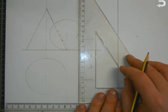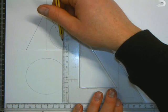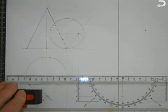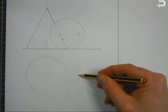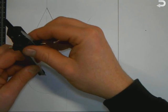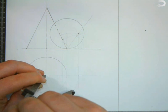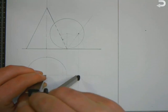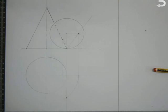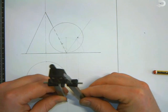To answer this question, we bring the center point of our sphere straight down, and bring our point of contact also straight down. From the center point, bring a line straight out. That location is the center point of a sphere which touches the cone when touching the side. Setting our compass to the center of the cone, we rotate the new center point around until it crosses over the line brought down from the correct position. This is our new center point in plan in the correct location. We then set our compass back to 30mm and draw the new plan.